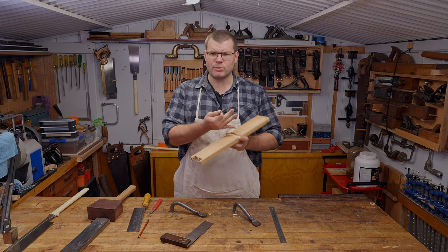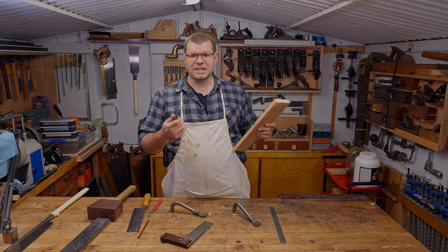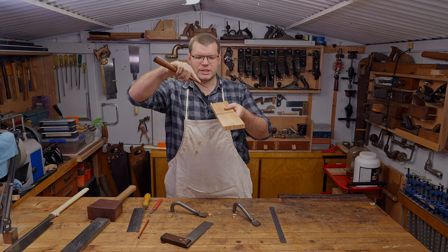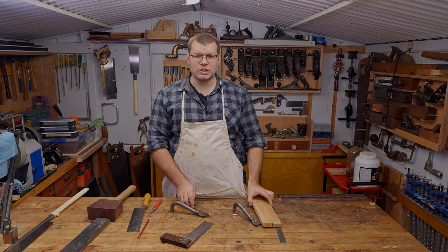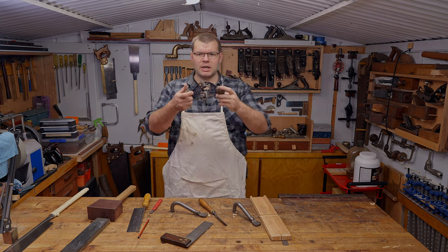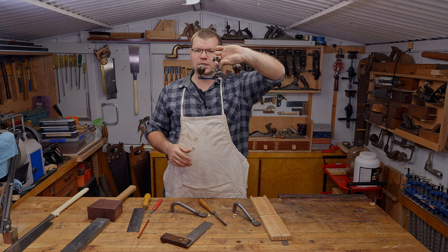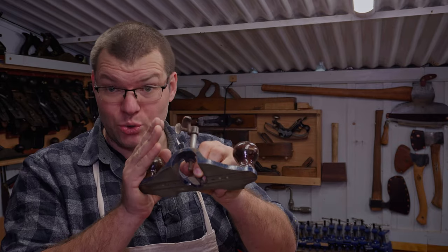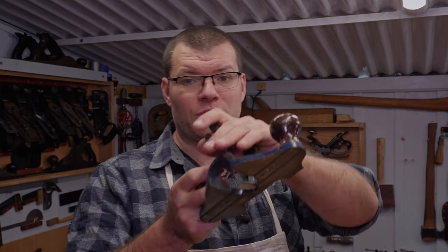You can see that with just the chisel it was pretty quick and easy for something this thickness. Now, if you've got something a lot wider, the chisel does become a little less accurate — you're relying a lot more in the middle and have to turn your chisel over to chisel that material out, which becomes a bit of an issue. You could use a longer reach paring chisel to clean that waste, or you could use a specialty tool such as a router plane, which I have here. We'll introduce this later and I'll show you the uses for it — it's really amazing what a router plane can do, giving you a fixed point to get the same depth right through a groove or a dado. It makes the process that much easier.